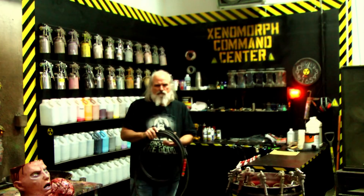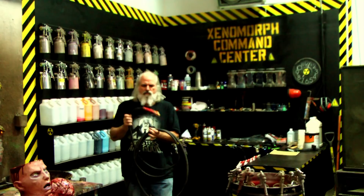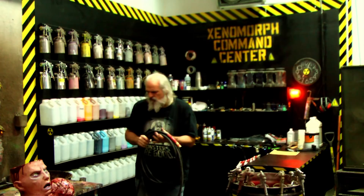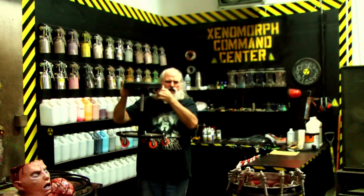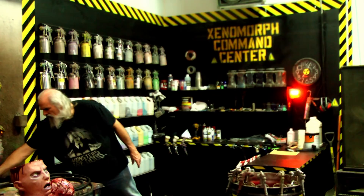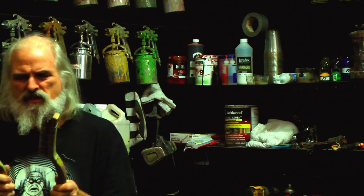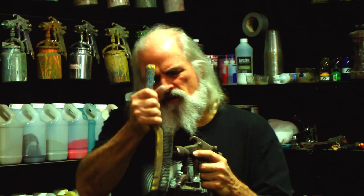For the compressor, keep it away from where you work if possible because they make a lot of noise. If it has to be in the garage or basement, try to get a quiet one. You'll need quick-connect couplers — female and male. A little chair on wheels is handy for getting down low. Very important: wire brushes. Almost every time I work with a quart sprayer, I clean it with a wire brush — pull the trigger while cleaning and that cleans the tip off really well.